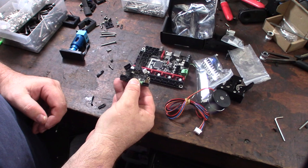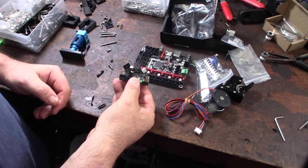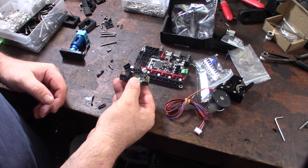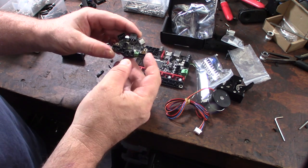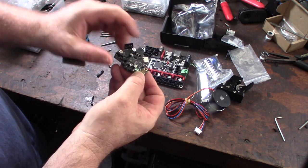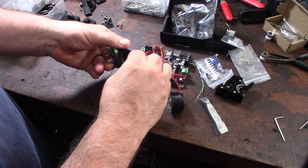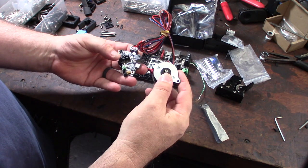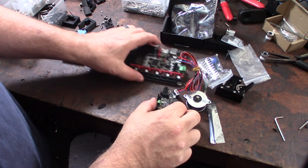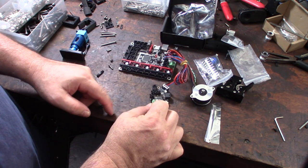I think this is geared more towards Klipper because I don't know if you could do multiple MCUs in Marlin. I've done many Marlin installations, but Klipper can support multiple MCUs. These things basically have a Trinamic 2209 driver on them and they control the extruder stepper motor, so that would go here. You basically control the motor — it's like an additional 3D printer board, that's exactly what it is.